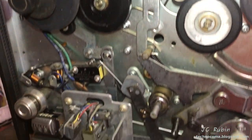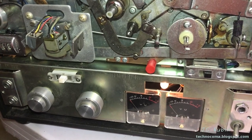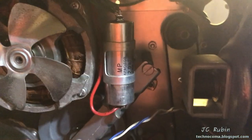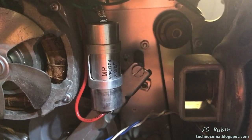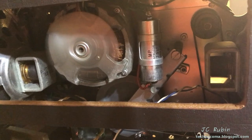Automatic set to off, stereo tape speed set to high — I'm going to fire this up for its inaugural smoke test. It's running! Looking at the tubes in the back — everything's glowing nicely, fan spinning. Since it's a first turn-on and I don't have a variac, I'm going to let it sit and monitor it. Worth noting: the 2µF capacitor on the top is not electrolytic and not polarized — when I first put an electrolytic in, it exploded. I've reverted to the correct non-polarized one and it works a lot better when it's not exploding in my face.